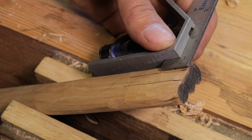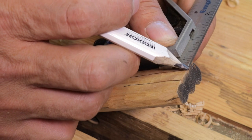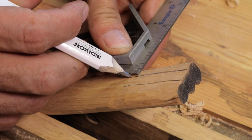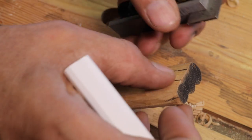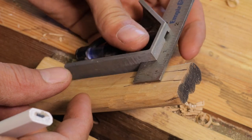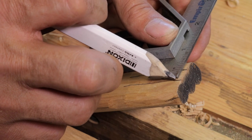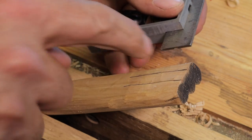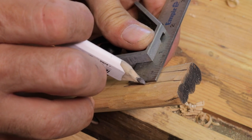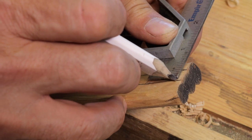So how I did this — may or may not be the best way — I used my small combination square to maintain the setting from the other side. I'm drawing a line to the bottom of the valley, the bottom of the trough, to give us some reference. It's hard to get reference here, and spray painting it on is really helpful. I've drawn the same lines on this side as well, following the contour of the head.